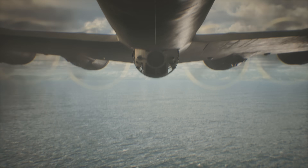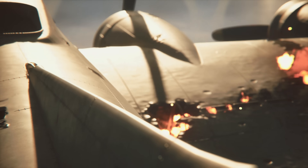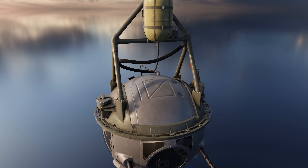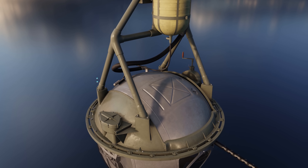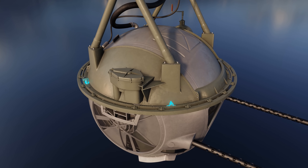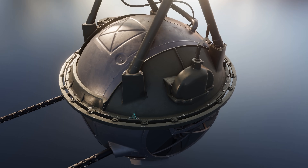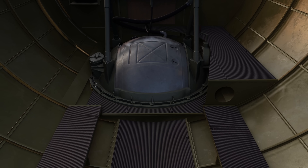This would be to prevent parachute snagging on the turret guns if bailing out, or to stop the guns hitting the ground during a standard landing. If landing normally, the gunner would lock the turret in position. But it could be jettisoned if the aircraft was going to crash land wheels-up, to minimize structural damage to the aircraft. In order to do that, the 12 connecting nuts holding the four harness legs to the turret support assembly had to be removed. Then the four safety retaining hooks coupling the turret support assembly to the turret ring also had to be removed, allowing the turret to drop away. This could be done by using a wrench or simply smashing the hooks with a hammer. In all, this procedure took around 20 minutes.